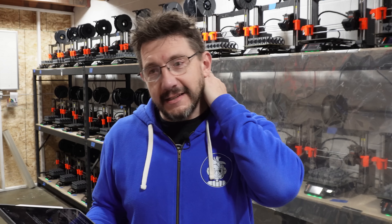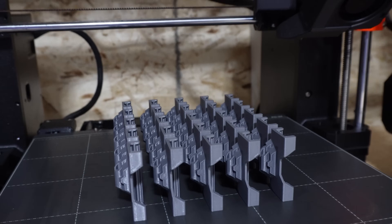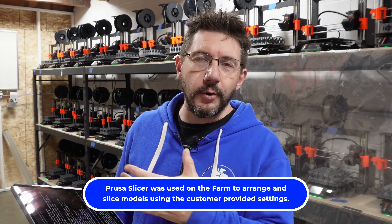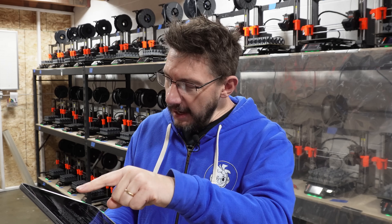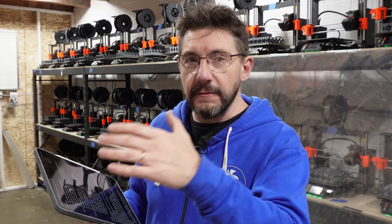Originally when we did this, we didn't have any order to what was on the build plate. Some plates had 10 parts, some had 18, some had 20. It was just me adding things in the slicer to what I thought would work in order to get as many parts as possible. I didn't throw any math at this. And then all parts were hand counted, placed into bags, and before shipping those bags would be double-checked by a human. This process made it possible for human error to be introduced a number of times, and I wanted to take that out of the equation.